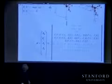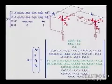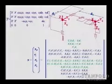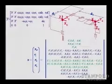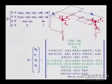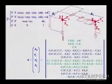So the forward kinematics, if we don't care about the orientation, is very simple. But if we care about the orientation, and we do care about the orientation, it is not very easy to capture. And now go ahead and find me the 3 angles associated with these. Right? How do we do that? Well, we say this rotation matrix is identified to 3 rotations, and we compute the inverse of the cosine of beta, and then we make sure it's not 0, no singularity, and then we extract alpha and gamma. And all of that requires you to take those numerical values once you plug them in.